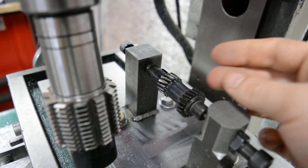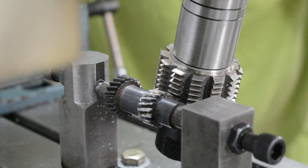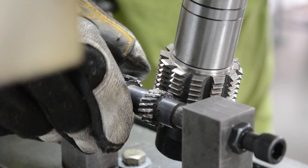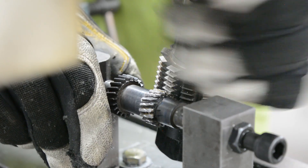I ran a few test cuts on some aluminum round stock. It seems to work best if it just free spins. You want to tension the bolts so there's basically no end play, but yet it can free spin like it's on roller bearings.